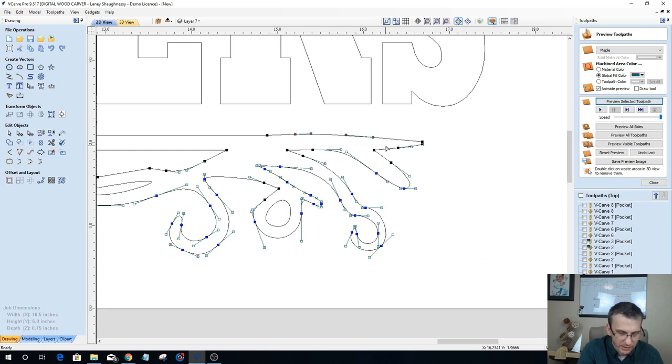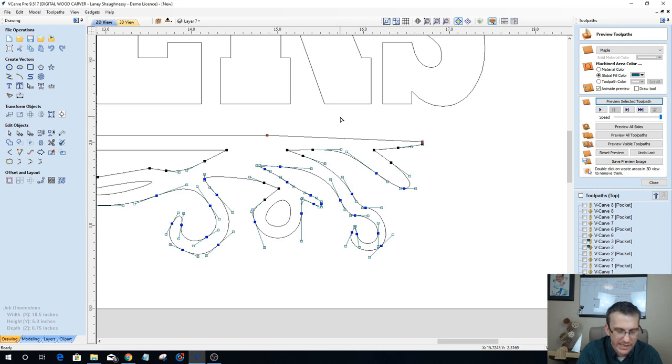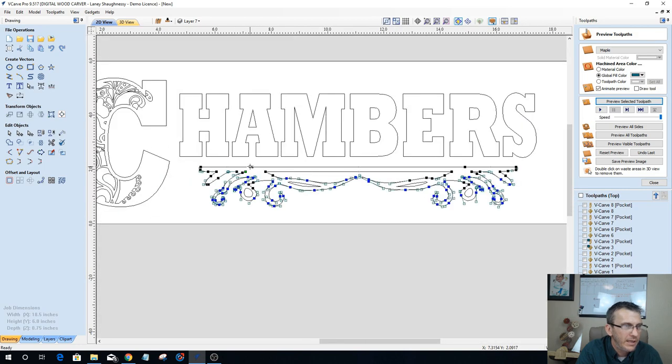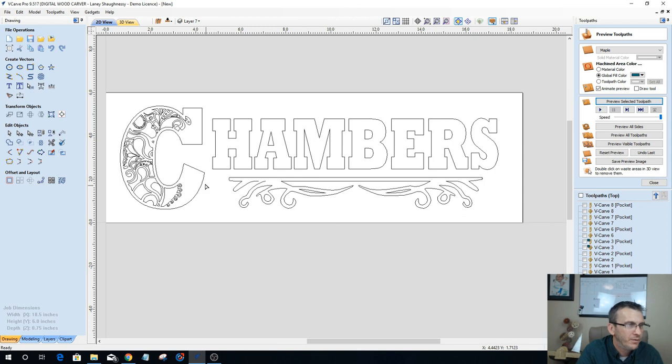Get rid of these vectors, hit the letter D on the keyboard to delete those. It always leaves one behind, so delete that. Select this first, select this one last, hit the letter Y on the keyboard to bring that up. Then I'm just adding a little bit of an arc there. Kind of smooth that out. Then I want to get rid of this point up here, and this point as well. And I want to make sure that these points are in line with one another. There we go. Just a little bit of cleanup on that vector. Not that great of a vector, but now